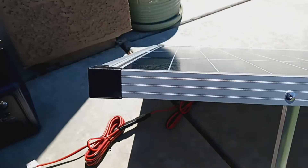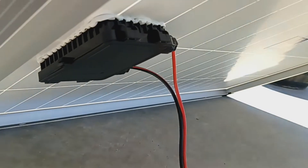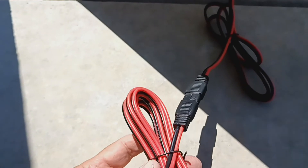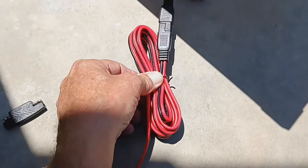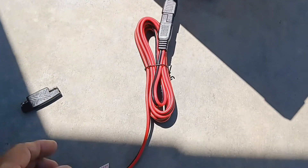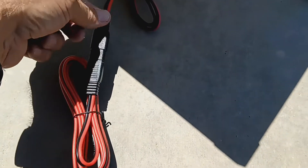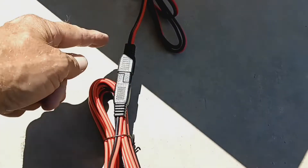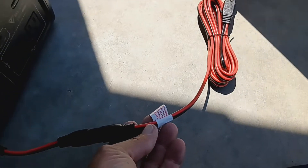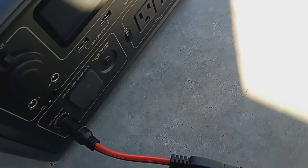Here's the wires. Now there's a lot of confusion about doing this. This is the wire coming off of the panel right here. This is the extension wire that comes with the kit. And some people are saying there's a reverse polarity issue where you need to use this adapter. Now if I put this end and connected it here, it would be different. But you see how I have red to red and black to black — same down here, red to red, black to black. Plug it in there.